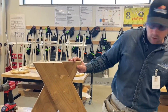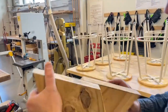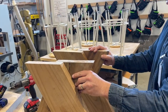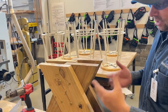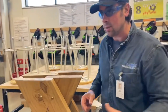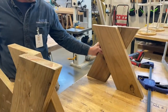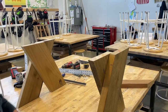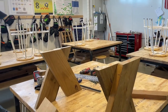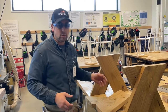We've now finished one of our legs. We want to make sure when we do the next set that we've got an opposing pair. Like this right here would be our same set — they are not reversible. This would be a same set, so we would have to take these apart if we were trying to use these as a pair. I could have maybe looked at that in advance. Opposing set — so this would be an opposing set here, or opposites, and that's the way we're going to build them. So we've got our braces going in here, and that'll be our next steps for assembly. Leg assembly — we've got this done. We've got our bench tops cut to length, then we'll talk about assembly for next steps.